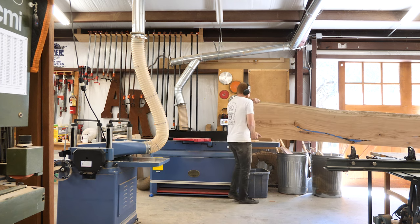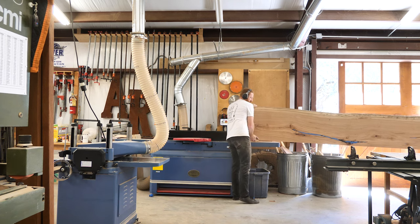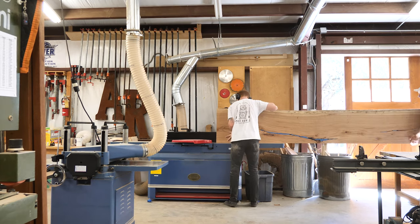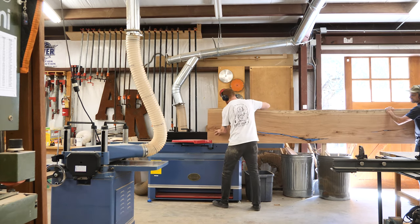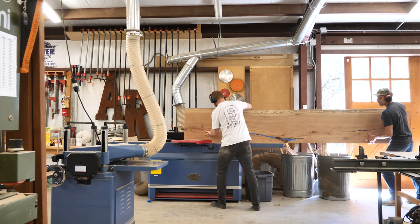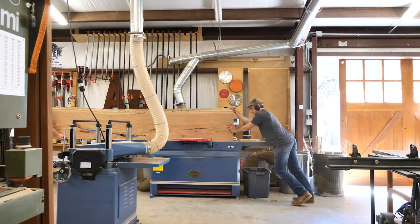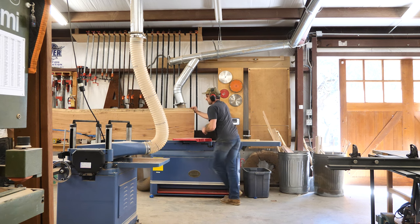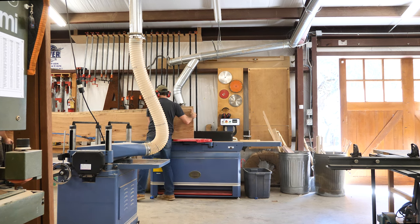This video is mostly going to focus on the top, on gluing this table top up. So we're going to start right here on the jointer. Robert's already straight-lined the edge off that we want to glue — did that with the track saw. We've also pre-filled these. We spent probably two to three days pouring epoxy in cracks and voids and getting it all epoxied up. That's the only epoxy work we'll do on this. I didn't really show that because epoxy is not that exciting.